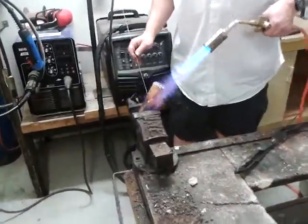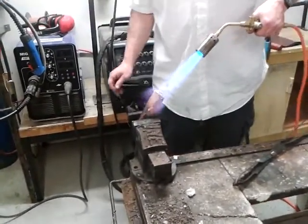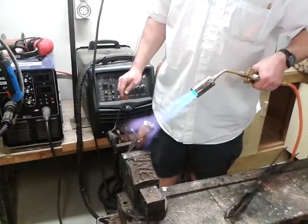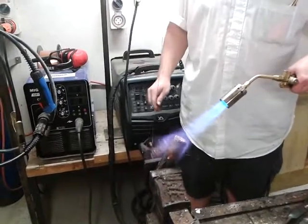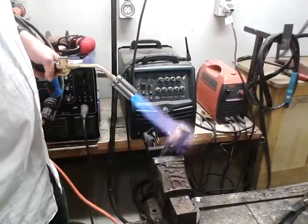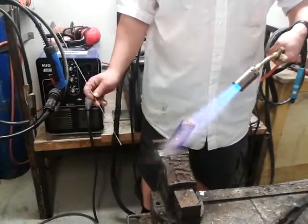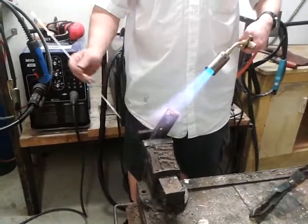Same as before. The whole tube's going to have to warm up quite a bit first. The reason why we've got it at an angle is so that when we put the silver solder on it, it wants to travel down and around. The other reason why you want to make sure no water gets in there is that on the second heating you can end up with a jet of steam coming out when the tube starts getting hot.